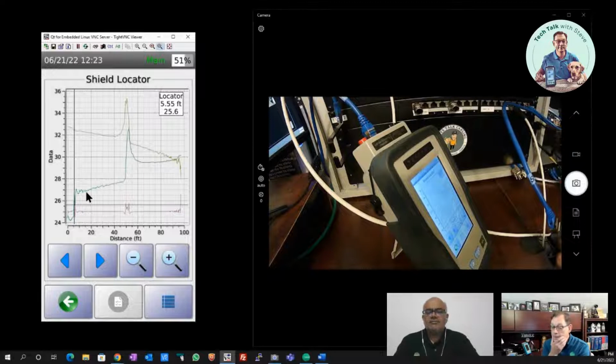Gotcha. Okay. And then if you're doing a channel test, then the recommendation is that the patch cords that are part of the channel test ideally be the same shielding type as the installed cabling, correct? Ideally, yes, Steve, but in many cases you will have the situation like what you have at your setup. So as long as you know what your system is like, I think that is fine. But sometimes we may be thinking that it's all the same type of shield, and if we see a step, then we should be worried that it is not what we thought it is. Right. It's not necessarily that there's a step, it's the intensity of the step, correct? That is another point. Yes, very good point, Steve. It is the intensity of the step.